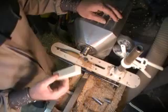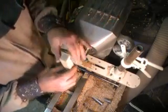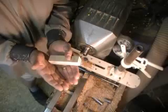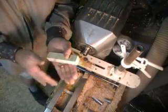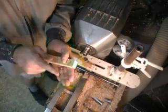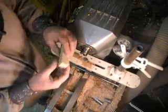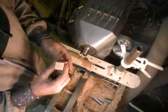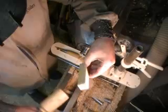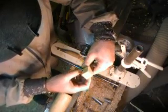So what I've done here — I've gotten a piece of hard maple, and I used my Veritas center finder over on the wall there. It's just two pieces of angle iron, two angles, a ninety degree angle between the two sides, and there's a back plate with a sharpened ridge running vertically. You put the stock in the cradle — it works for square or round stock — and you put it in the cradle.